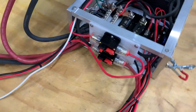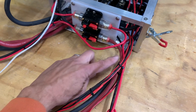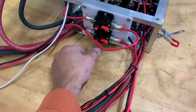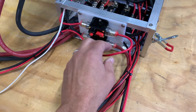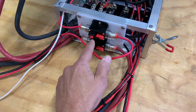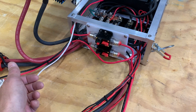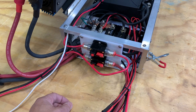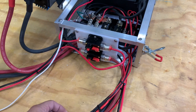On the backside, there are a couple of circuit breakers for input lines. From the alternator coming in, I've got a 50-amp circuit breaker, which I use as a shutoff when I want to shut everything off. The solar panel comes in through a 20-amp circuit breaker. I've got a separate house battery shutoff off to the side. I also have a shutoff by the starter battery up front in the vehicle for killing the line from the alternator back to here.